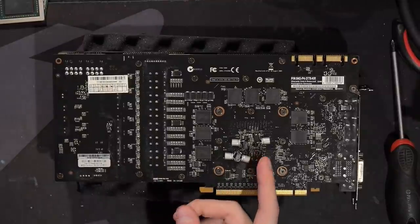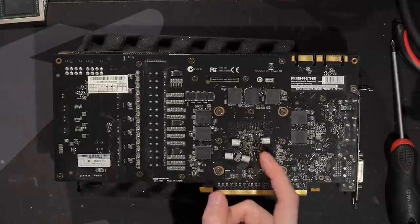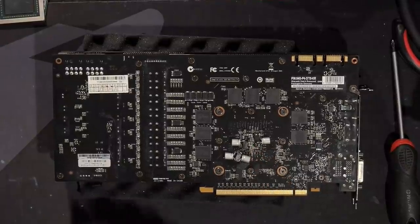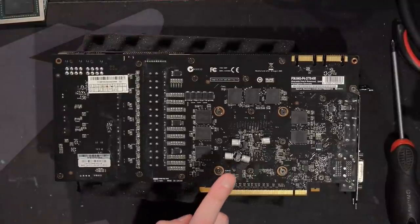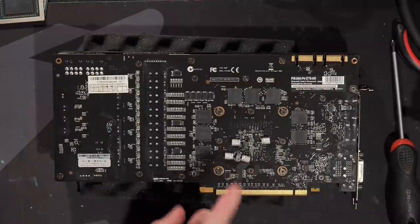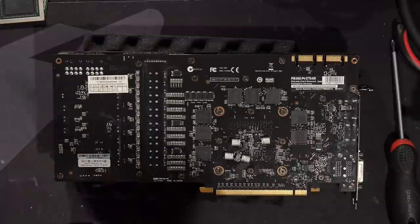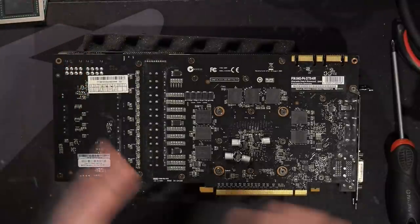With GPU cores, the thing we're trying to filter is very rapid switching noise from the silicon. These aren't ideal for this application, but the 1200 microfarad through-hole caps are significantly cheaper than the SMD 470s, and since the impact is roughly the same, it's not really a problem — I'm cool with using them.